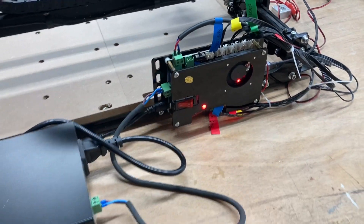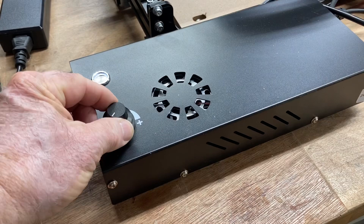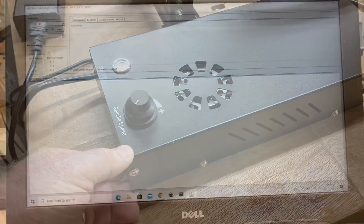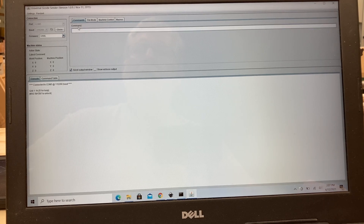Today I'm going to use the computer, but I want to show you that you have a lot of versatility and options with this Basic Edition CNC machine by Fox Alien. We're going to go ahead and turn on the controller. I have Universal G-Code Sender set up and I know this operates on COM5, so I'll click on that and hit Open. Then from the command line I want to change that spindle control setting for the spindle speed, so I'll hit dollar-sign dollar-sign.